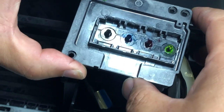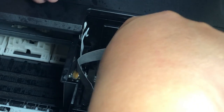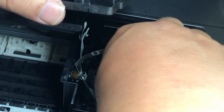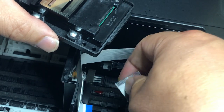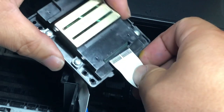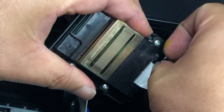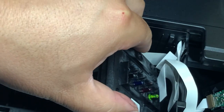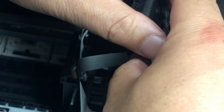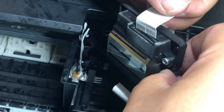To install, orient it with the serial number towards you, then flip it upside down, and you need to flip the cable upside down too. Make sure the cable is clean, then insert it, and flip the whole thing backwards. The little serial number label should be towards you and the metal part towards the bottom. That's correct.